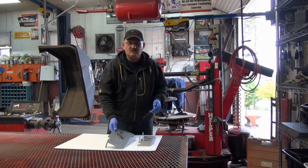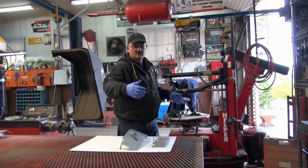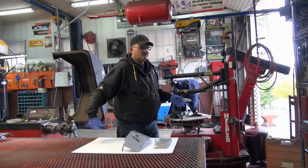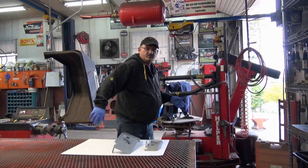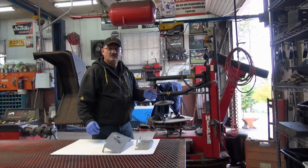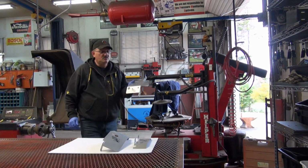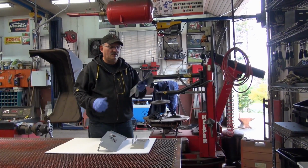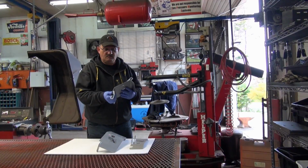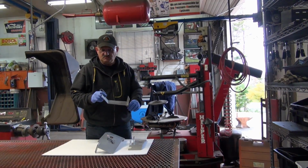Yes. So that's on, as you're sitting on the tractor, the right hand side of the tractor, up under by your rump underneath. On the left hand side you have your HST filter. So what we've done, we've come out with a cool little guard for that as well. It's 1/8 plate. It's very heavy, very stout, I guess would be the word that you would use.